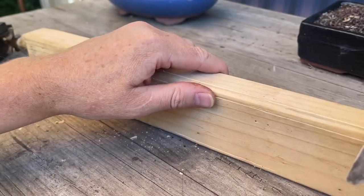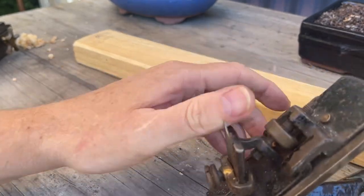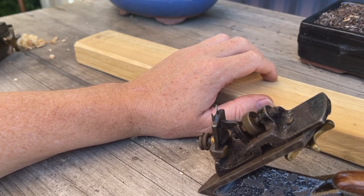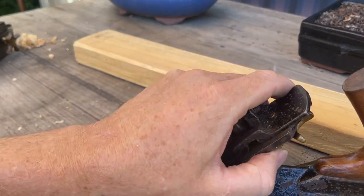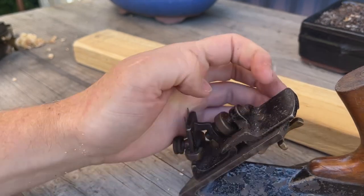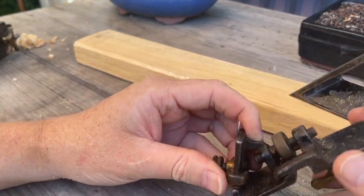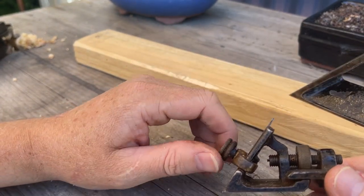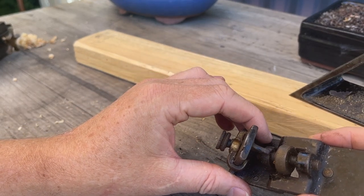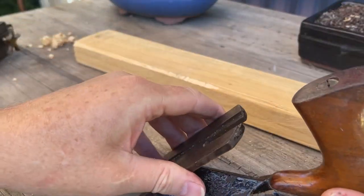Of course you have all the different sizes and multiple rounds and angles available in the scratch plates, and you can make your own patterns in the scratch plates too. When applied to the 72 and a half, they're always applying at a 45-degree angle to the timber, which just gives you another dimension in creating your beads. It enables you to create some beads that are actually difficult to create with a router. For that reason, although I don't use it very often, when I have used it I've found it creates a lovely result that I've not been able to replicate with electric equipment very easily. The issue is that this is done easily, whereas electric equipment can't always do that 45-degree angle easily on a budget — you have to spend more money or more time creating jigs, whereas this is done very quickly.